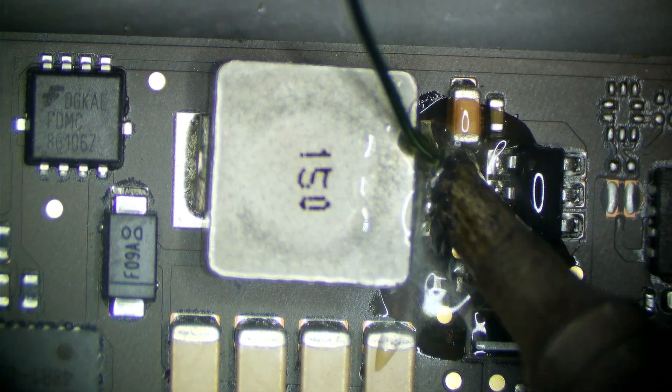We're going to solder a wire to one of these capacitors or the backlight coil. It's useful to solder to the coil because if you solder right next to the shorted component, the heat might confuse you as to where the short actually is. We'll put a little bit of flux down, get our wire soldered, then inject a little bit of voltage. Backlight circuits generally take a lot of power to light up, so we don't need to be too careful.